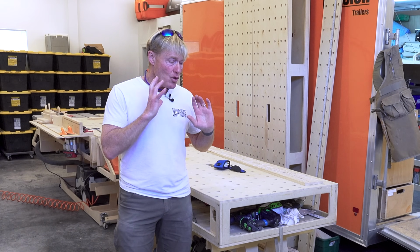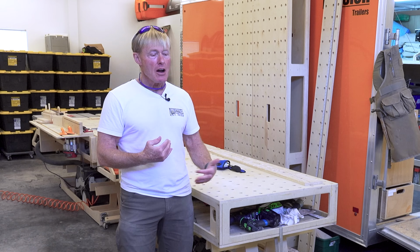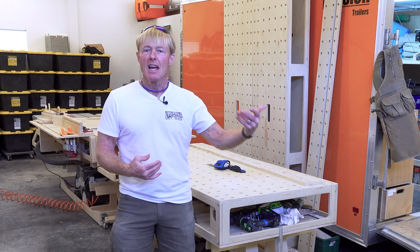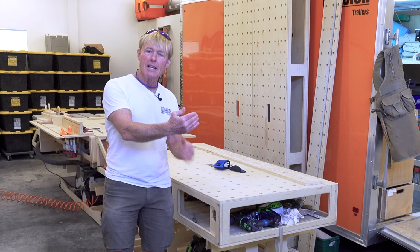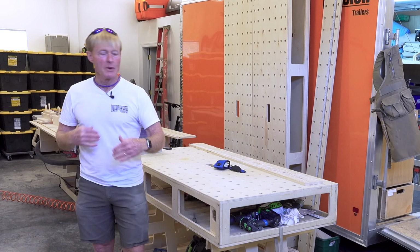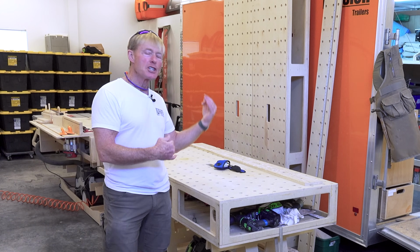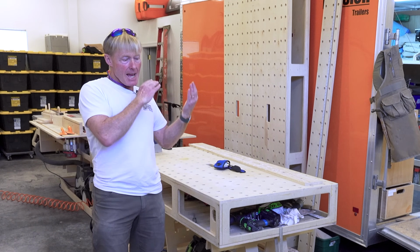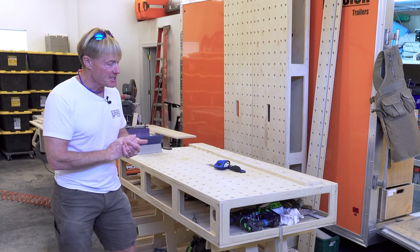And so developing systems, I plan a house out from the day that I hand the keys to the owners and say, enjoy your new home, backwards. I figure out where I need to be, what date I need to be on there, when the materials need to arrive, when the cabinets need to arrive, the windows, when the drywaller needs to be there, when it's going to be painted. All of that's planned and put on a Gantt chart. And I start at the end and work backwards and set the dates, and I hit those dates.